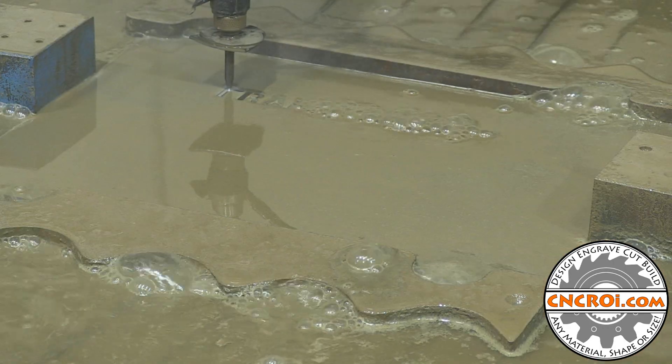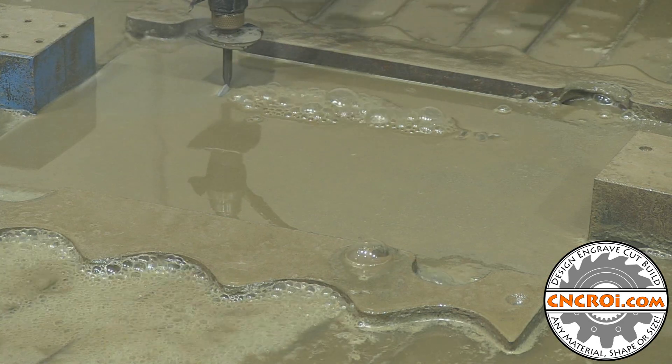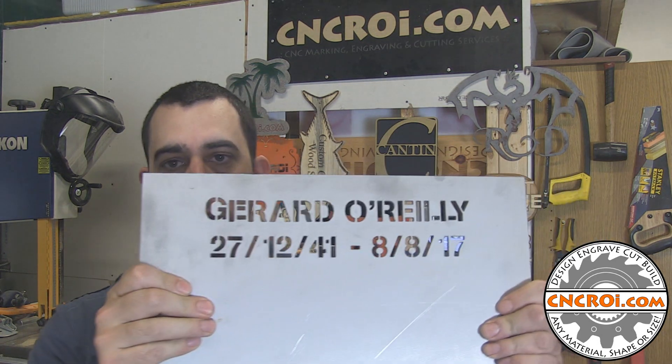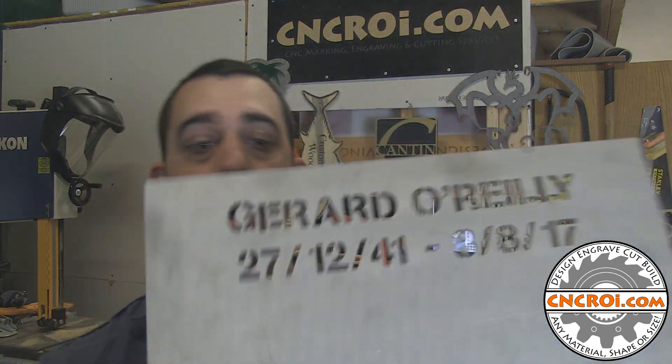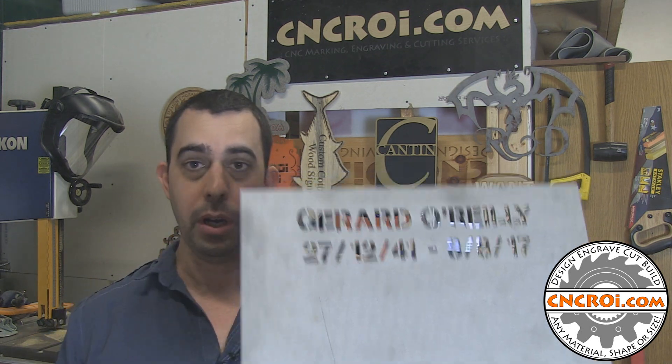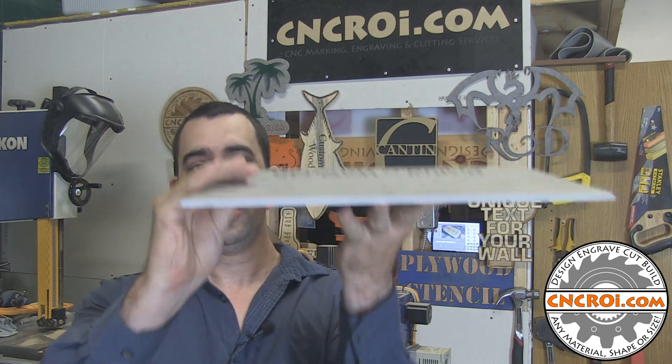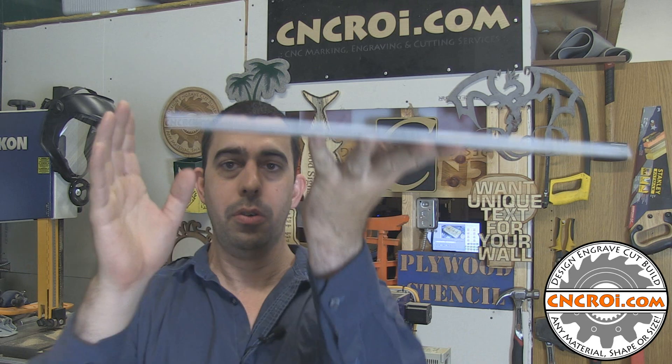What you want to look for is not actually the plate moving — it's the whole assembly moving. One of the nice things about having a lot of video of the work we do is that you can go back and see where things went wrong. Everything looks good until you get close to here. In the water jet, you have the metal on top and slats going across to hold the metal, otherwise it would go straight to the bottom of the tank, which is not a good place to be cutting metal from.